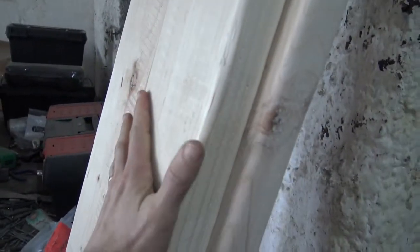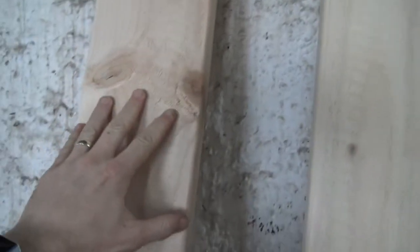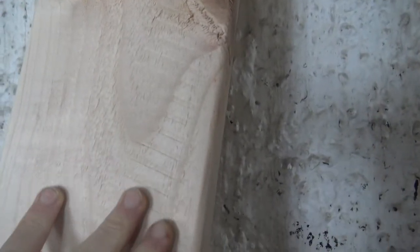What you can do, and this is what I'm doing, is sand it down, take the edges off, and create a surface you can touch without getting splinters. These are the top parts of the bed — this will be the top rim — and I've sanded these down pretty well. But you can still see the giant blade marks where the teeth of the saw cut through the wood. I'm going to keep sanding this to get it down to one smooth surface.